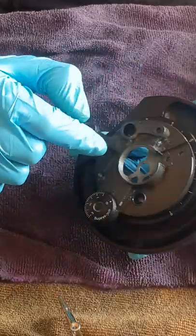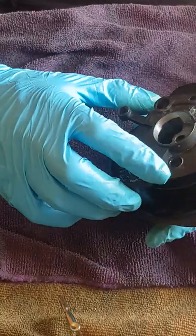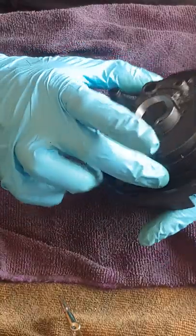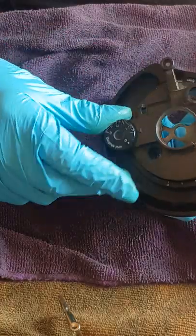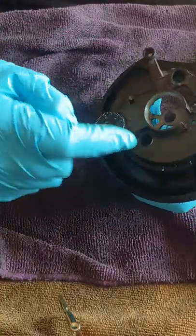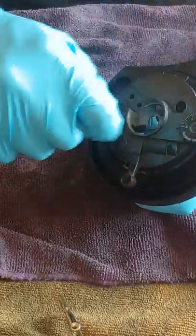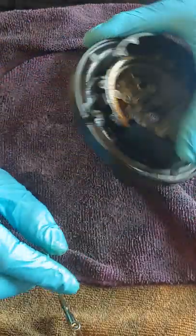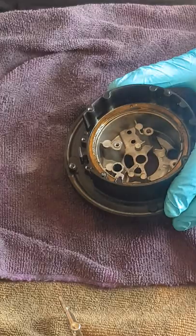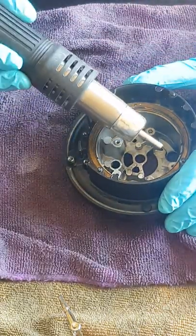What I'm going to do is try some heat on the inside to free that grease off. If you turn the bezel anticlockwise that locks — that should undo. If you go clockwise, that bit undoes from that. So you want to go anticlockwise, and I'm going to try to heat this bit up and hopefully it should free off.